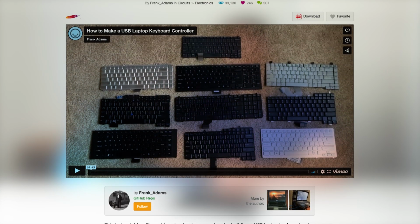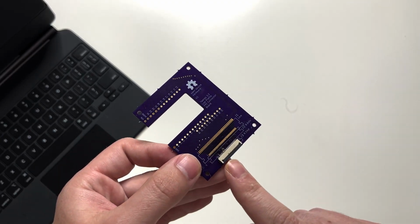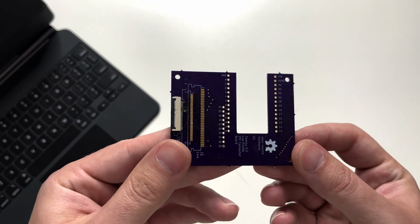All of this comes from a gentleman named Frank Adams, who has a wonderful Instructables guide, which I'll link down in the description. Frank has been a godsend for me because I've asked him many questions during this process, and he helped me along basically fabricating a custom board that would allow me to take this keyboard input, this ribbon input, and convert it into the teensy. This was a long step of the process because it required waiting for these boards to be fabricated, and then it required me to solder them.